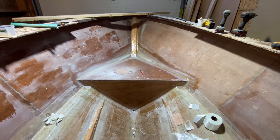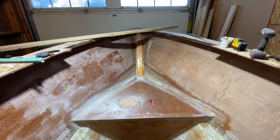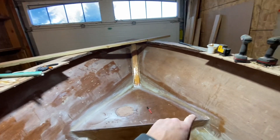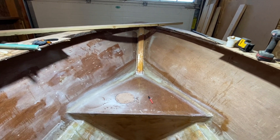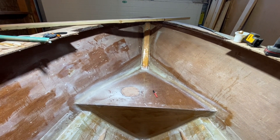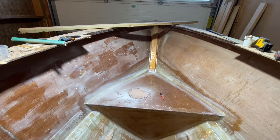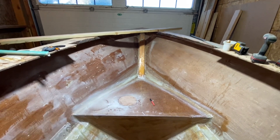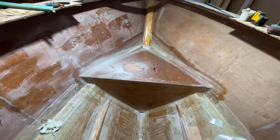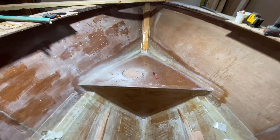Sorry I didn't film while I was putting this in, but it was awkward and just a lot of repetitive work. Two pieces on top — right and left — fiberglass the backsides, epoxied the edges where they were going to go, set them into place, temporarily screwed them in, then glued them in. I used a lot of thickened epoxy around the edges to get it to adhere to the boat side, and then I did the four-inch tape over the fillet to smooth it out. Down below I have the fifteen-sixteenths drain plug that I made earlier.